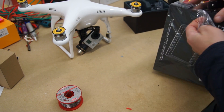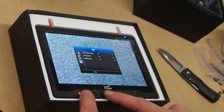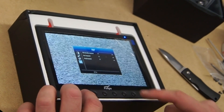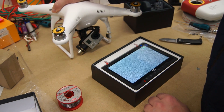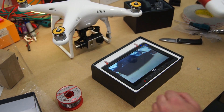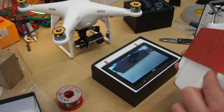And here is our FPV monitor — the Black Pearl, a 32-channel diversity 7-inch monitor. The first thing I'm going to do is select Band F. Band F is the channel band used for Immersion RC. There are four bands in total covering the 32 channels — so for example if you're using a Bosscam video transmitter then choose one of the other bands. This is our first power up, and as you can see our video is working perfectly. Make sure to test the gimbal — move the slider on the back of your transmitter and see if the gimbal is moving up and down freely. As you can see our gimbal is working perfectly.